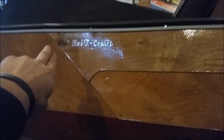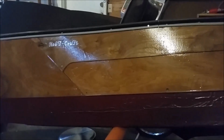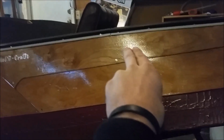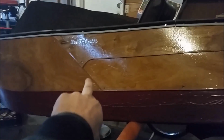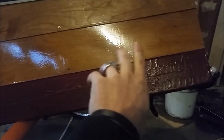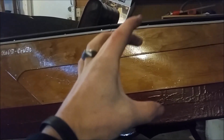But when I tried to bend it, it cracked. So what I did is I cut a 22 or 45 degree angle there and used 3 different 6-inch pieces of the same stuff, actually the same board. So these cuts were already made to match up right, and they were easily bent because they're overlapping and they're so small that they'll twist and turn and curve.